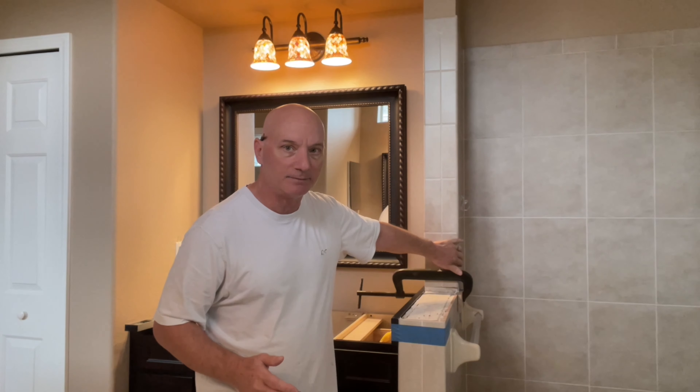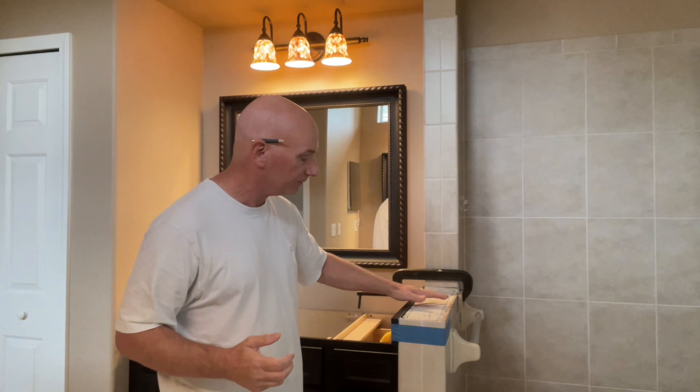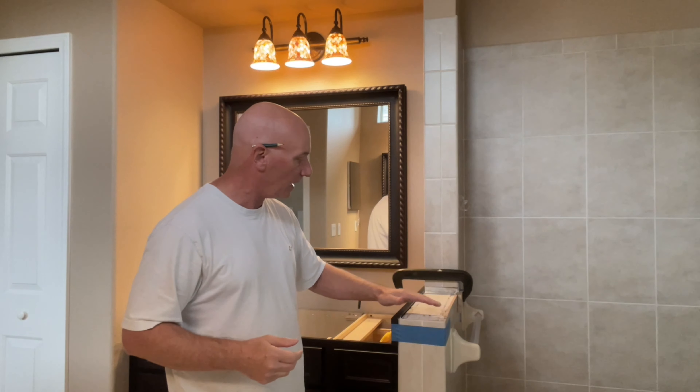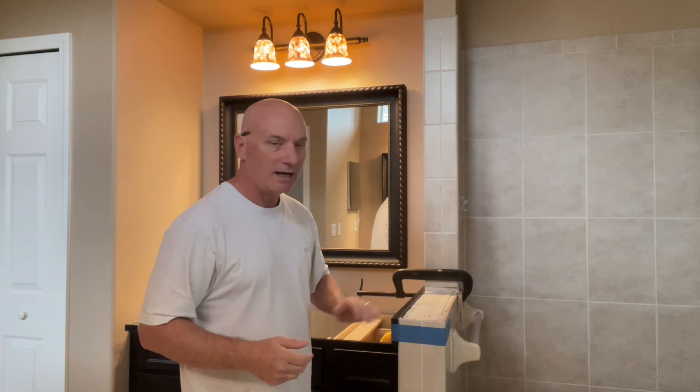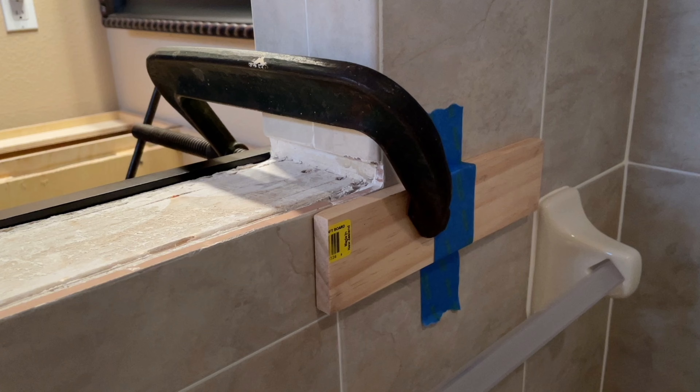With regard to this little platform here, we're going to have quartz installed to match the cabinetry countertops as well. I wanted to get rid of the old genuine imitation simulated marble — I got rid of that yesterday, broke it all up and took it out. The problem is that's not level, so I have to go by the tile installed on both sides. I created a form, put a C-clamp against it, and on the other side I have a block of wood to protect the tile. I bought this stuff called Henry's pre-mixed floor patch — it's supposed to harden and I'm going to float it in here.